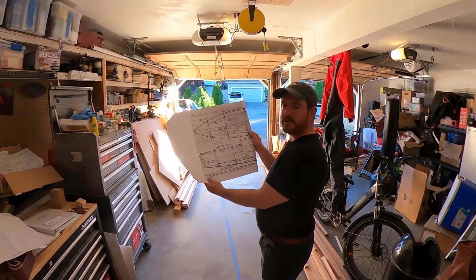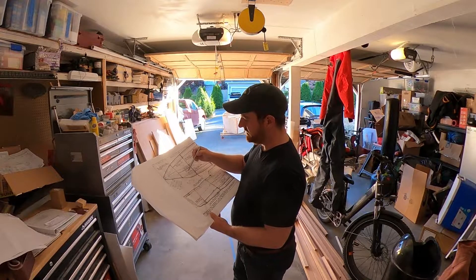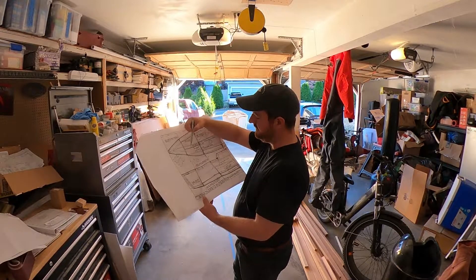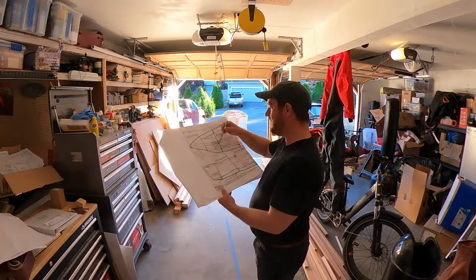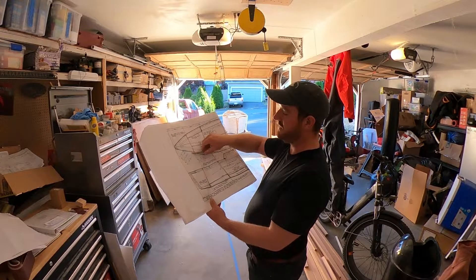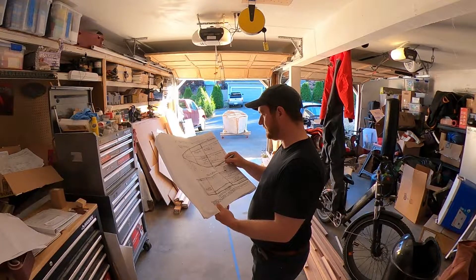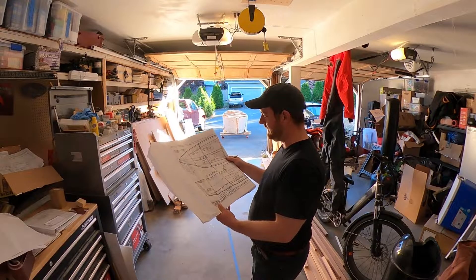I have a large print of plans where the scale is kept in X and Y. Basically I just took a straight edge and tried to do my best to draw a tangent line at the joining point between the cleat and the hull side. I don't expect that you can see the detail writing on this necessarily. I also drew a line parallel to the center line of the vessel, and this gives me a triangle that comes together at the bevel. A little trigonometry — an arc sine, for example — arc sine of the length of the opposite over the hypotenuse side will give you the angle that you have at that joint.